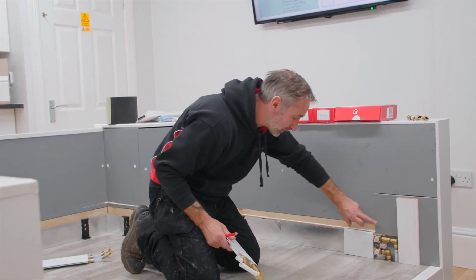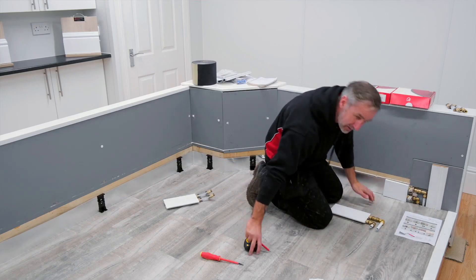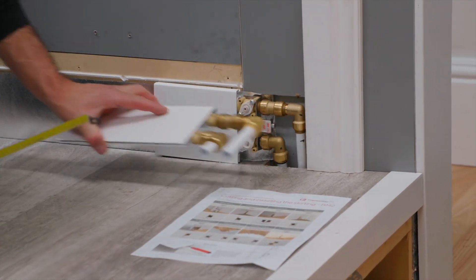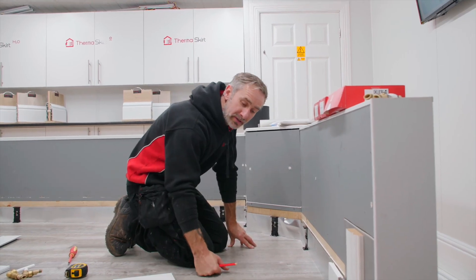The skirting starts with a TRV kit or a non-TRV kit. In the instructions there are two sizes for this — the manual TRV kit is a deduction of 120mm and the non-TRV kit is 100mm. So I'm going to walk you through the rest of the deductions.